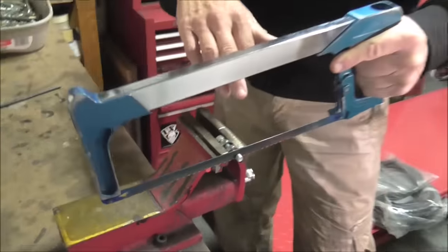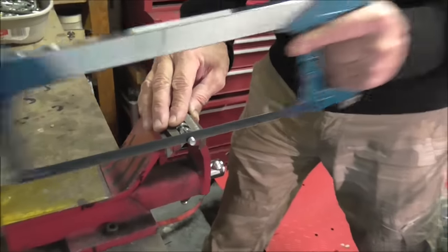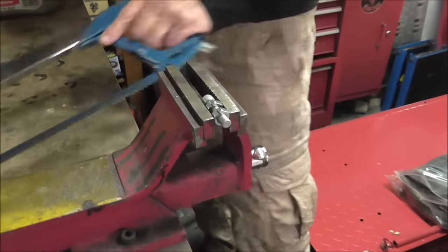When you go about three quarters of the way through, start listening to the note from the saw. It will go deeper — the pitch will drop. You'll hear that back-and-forth sound drop in pitch, and that shows you're getting to the end of the bolt, it's getting thinner and thinner. Before it snaps off, you can then ease the saw. As you hear it change, press less and less hard towards the end of the cut.